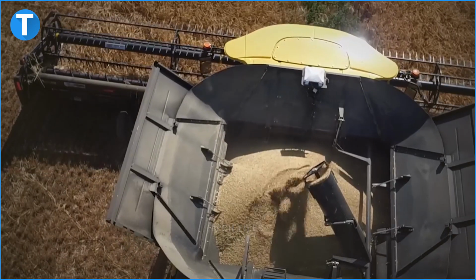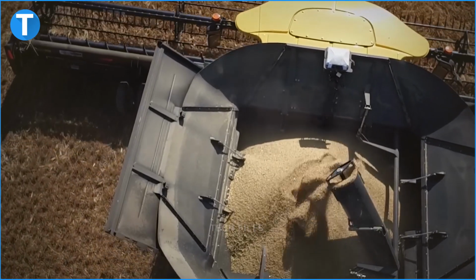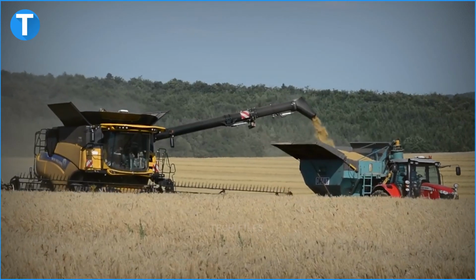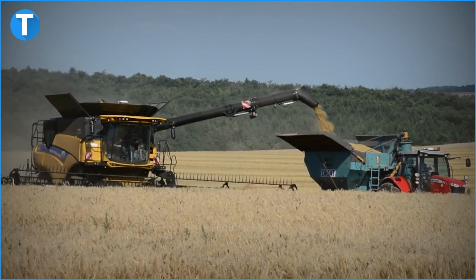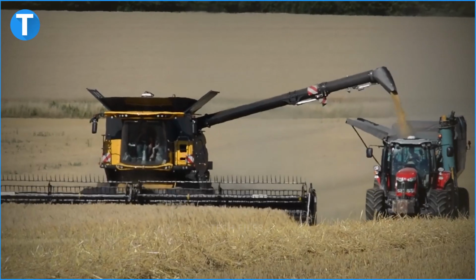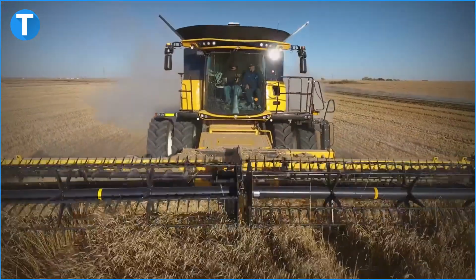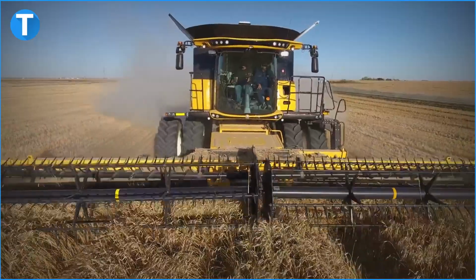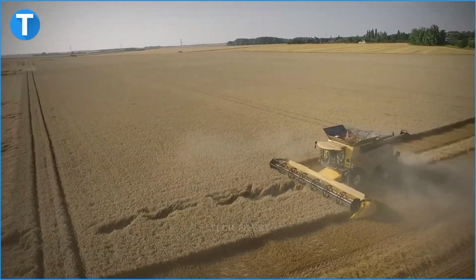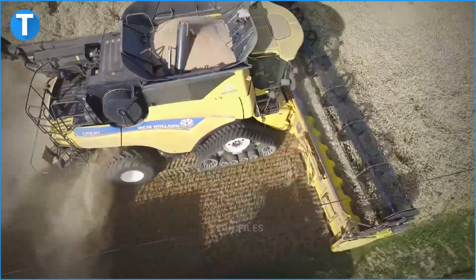The grain tank size of this machine is 11,500 litres for a considerably huge harvest round. The transport length of this machine is 9.97 metres, while the number of cylinders is 6. Other special equipment of the New Holland CR990 combine harvester include loss monitoring, a straw chopper, and a cabin. The loss monitoring feature is especially good to improve your harvesting techniques and reduce crop losses.